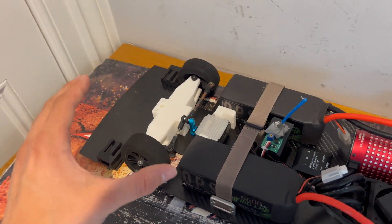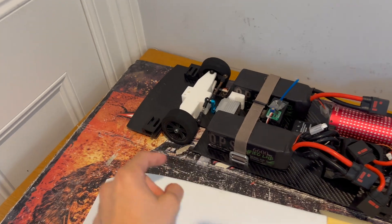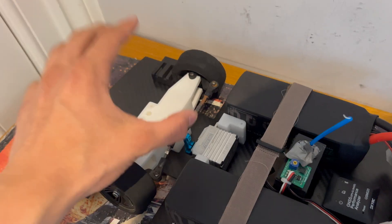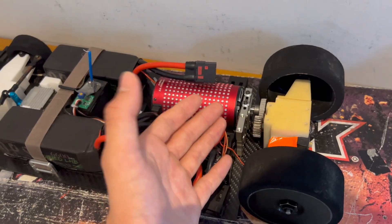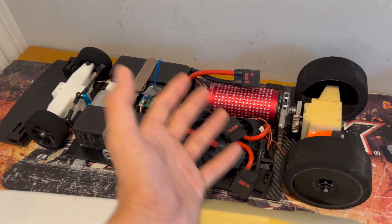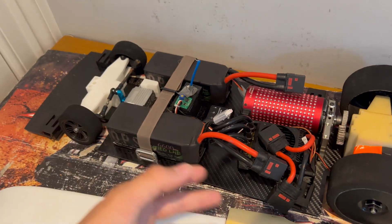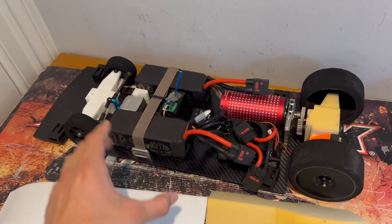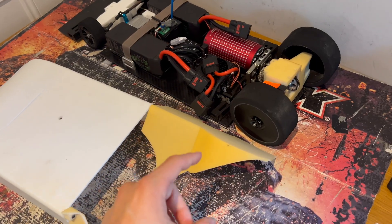The rear diff itself is still meshed absolutely perfectly. In terms of stability, I think the lack of caster angle at the front is playing a big part. If you look at the Arrma and Hobao cars, the front hubs are tilted slightly backwards and that's what helps keep the cars pulling a straight line. On this car everything is straight, so if we add some front caster to the front bulkhead that might solve the issues. But I think I didn't help myself with this much power — this car would be better suited as maybe a 4S or 6S car.